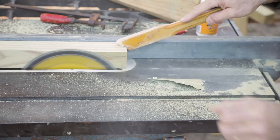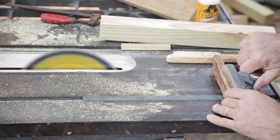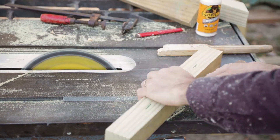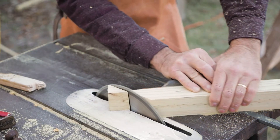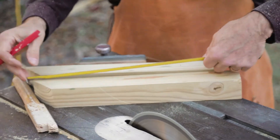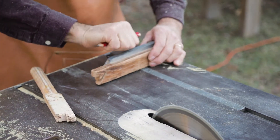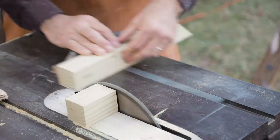Use a push stick. If you're cutting pressure treated lumber and creating a lot of sawdust, it's a good idea to wear a dust mask or respirator to prevent inhaling dust from the chemical treated boards. Now I have two two-by-twos. I'm going to get rid of the rip fence, use my miter fence, and cut the ends to 45 degrees. Then I measure the boards — one is going to be 14 inches finished and one is going to be 16 inches finished. That gives us our bracket: the vertical and the horizontal portion of it. I reset my miter fence to 90 degrees, use my speed square to confirm a good 90, and cut these boards to length.